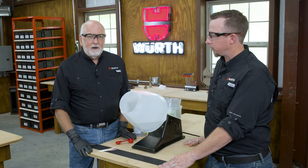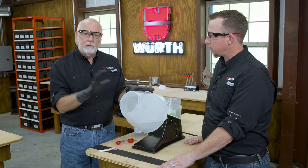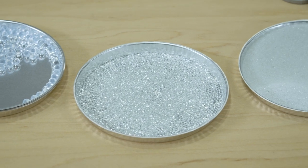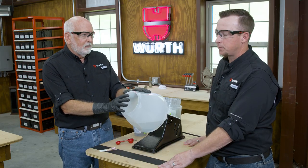Let's get started. We've already put our PPE on — safety glasses — and because I'm going to be handling chemicals, I have rubber gloves on. We put our water into our tub, our cement mixer, and we've made sure the pH is right. It needs to be down below two, so we have that correct. We've also put the glass beads in — three sizes of glass beads. The larger beads are about half of the volume, and the other two parts are made up of small beads. The beads also need to be equal in volume to the parts going in there.